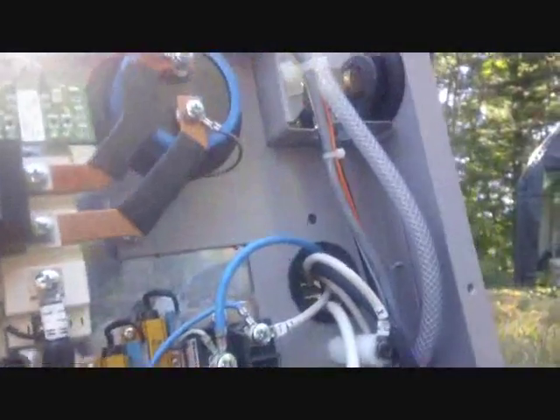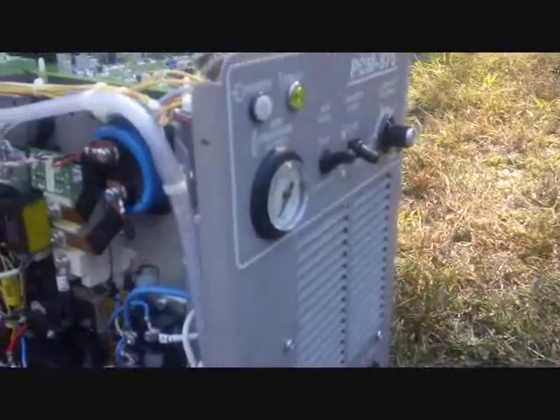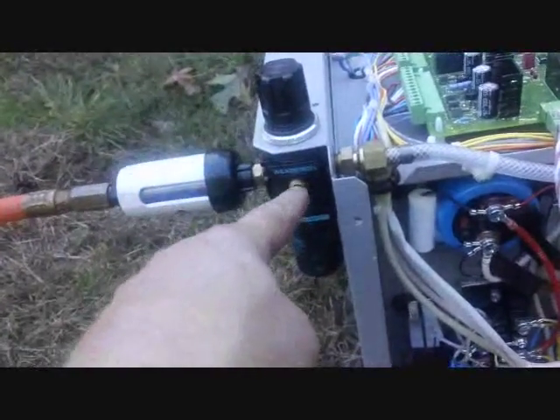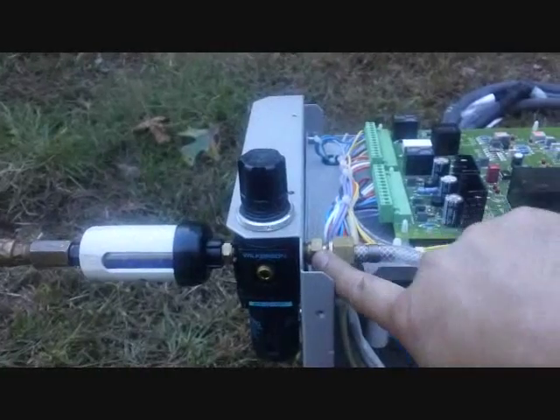Let's see if I can't see where that hose is going. That hose goes down to... well, there we go. It goes to this solenoid, and this solenoid apparently lets the air come back. This is the line going up to that air regulator right there. That line is just teed off of the input of the solenoid, so it should be reading whatever pressure is going into this thing, even when it's off. I've been playing around with this and I've come to the determination that there's no air passing through my regulator — I think this is where the problem lies, right in this unit. I've loosened this up and didn't hear any air, so I'm going to take this off altogether and see what I hear.